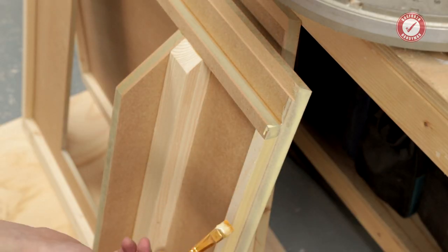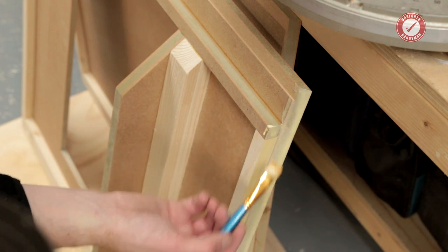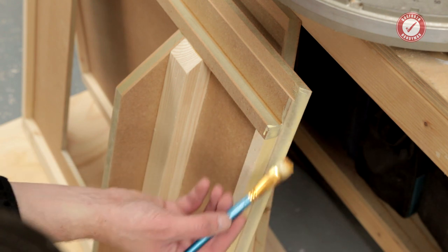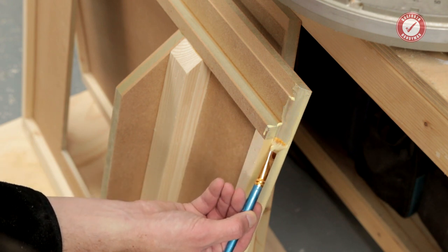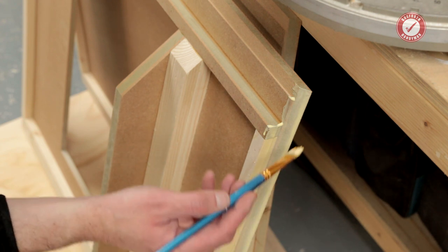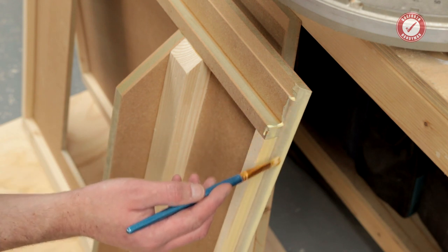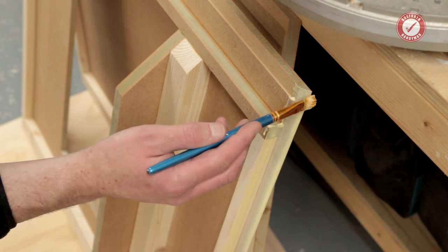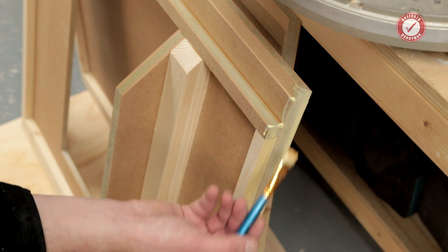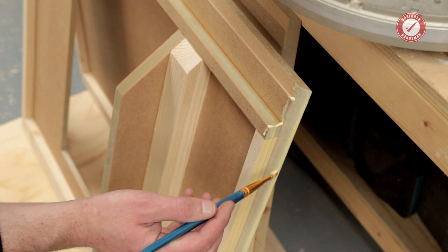What I aim to do when I'm putting the glue on is to get a nice bead of glue on that outer edge. Do you see how I'm trying to pile the glue up on that edge? That will just help when I attach the miter — it'll help to fill any voids in that edge and get a nice strong bond along that edge, which is obviously going to be the visible edge. So that's why I try to get a bit of a build-up of glue along there.